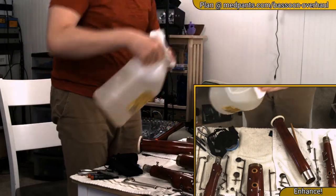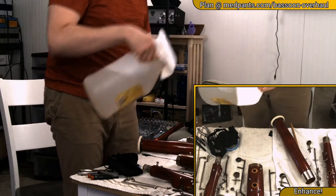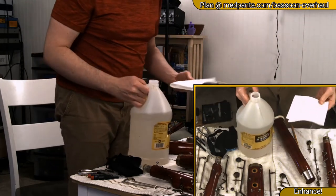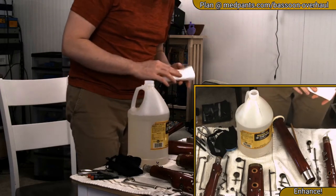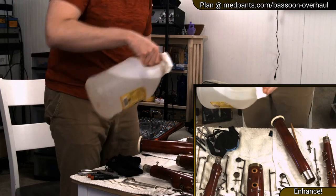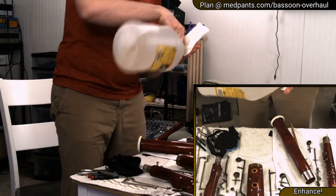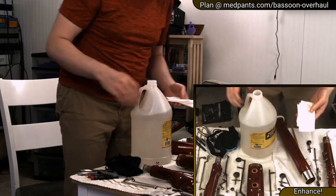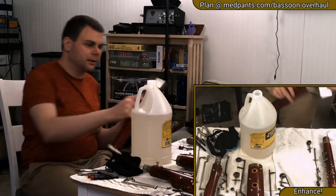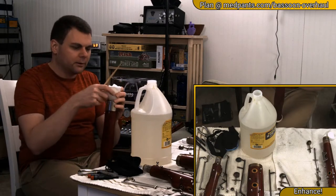And it is important when you're applying the oil to the cloth like this that you actually seal the end, because if you leave a little gap, the oil will just spew out. It's less than ideal. This is probably too little, but that's fine. So let's do this. It's big. And if you're using paper towels and you're pushing too hard to get it through, it will also just rip the paper towels where you're pushing on it. So it's another reason not to overdo the tightness of the thing you're driving in.